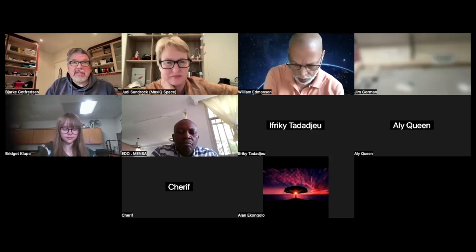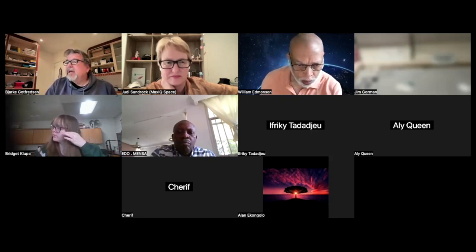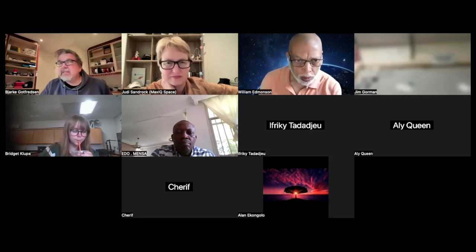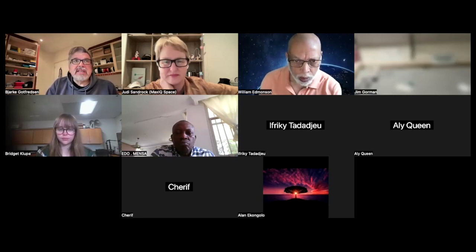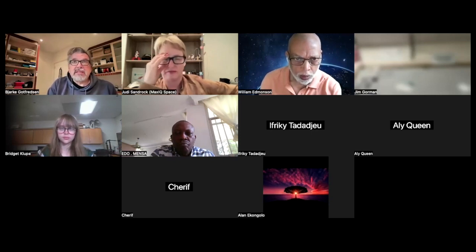I have done a prototype similar to this, with a microphone, which is also arriving together with the new side panel here. And that's actually using those exact pins. The interesting thing with a microphone is that it's not necessary to record sounds. That's one thing you can do with it, but you can do a fast Fourier transformation analysis and pick up frequencies. So if you hear a specific frequency, or anything like that, you can use it to measure sound pressure level. So there's a number of different things you can do.